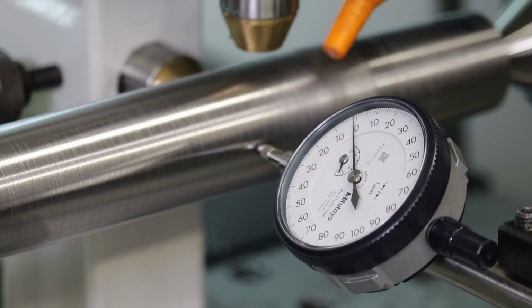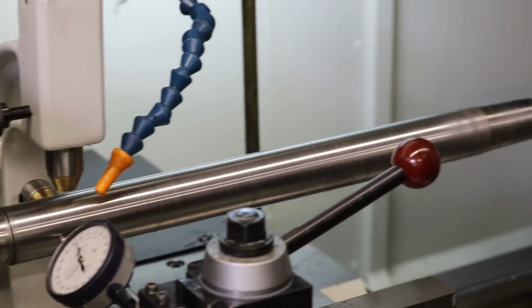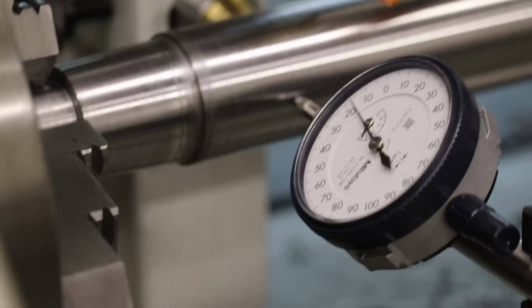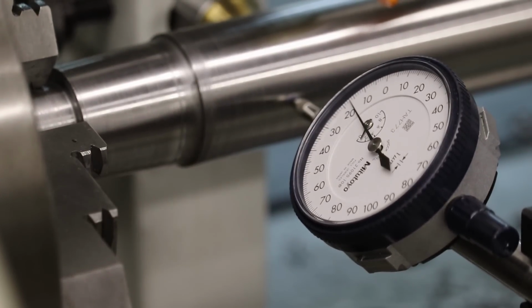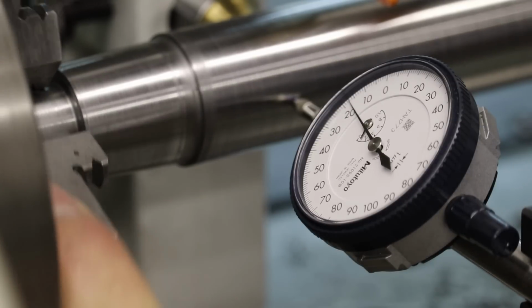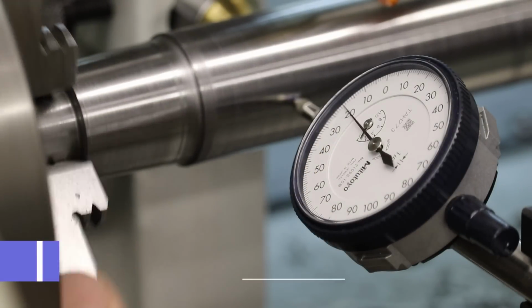It essentially reinforced the live center and the tailstock. The live center has a little warmth on it too, so that's cool. We didn't get that before. I think some of that needle bounce is just the subpar finish. Okay, we're down here by the chuck, and you can see that we are minus about 17 or 18 microns. There's minus 20 microns. Anyway, we're 20 microns off down here.